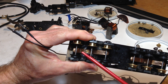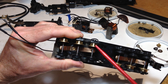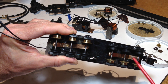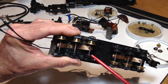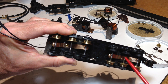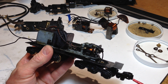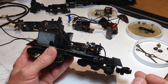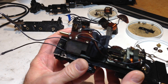Underneath you have your leaf pickup springs — one on the front truck, one on the rear truck. There's no pickup shoe as came on later models; instead there are three wheel sets per truck and the middle one picks up power through the energized side frame. The real connectivity, however, is with these leaf springs on the fore and aft axle of each truck. It's usually a link coupler engine, but it's not uncommon to have these converted to knuckle couplers as this one has been, since knuckle couplers are more convenient and compatible with a wider range of rolling stock.